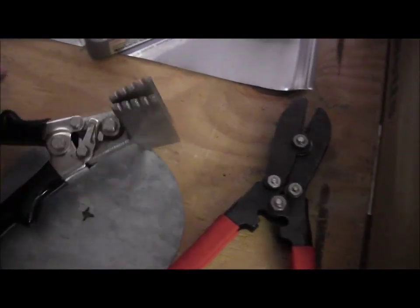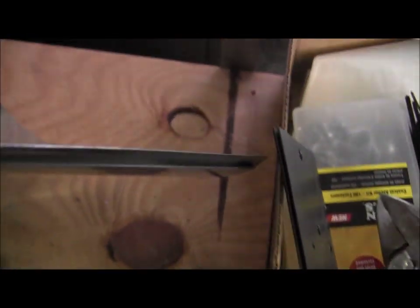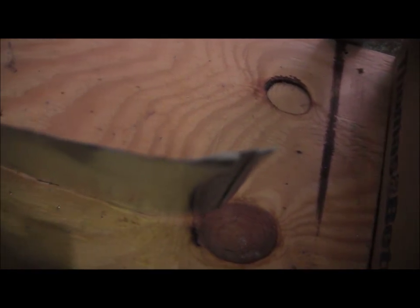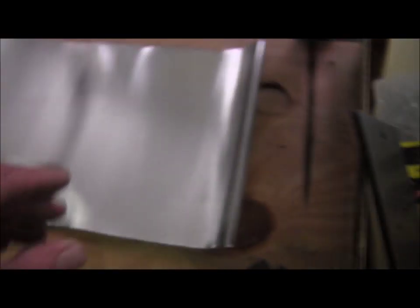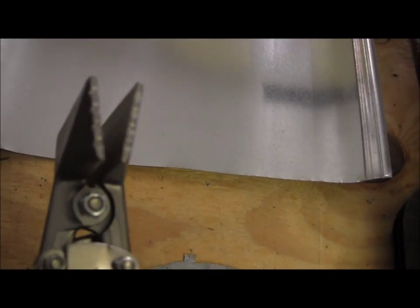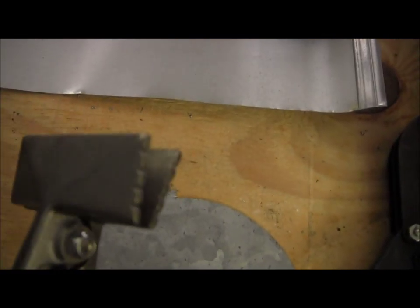First off, with the metal, when you're trying to crimp the joints together and close down the seams, for instance, with this stuff, see there's a seam there in the end of the metal that needs to be closed. That's the crimp joint on the end, and probably a better view of it would be here on the actual duct. As you can see, the edges, as they go together, get a little dinged up. Well, all that's totally repairable with our little crimp tool, which is this guy. And he's gauged. See, there's little notches on the jaw, and the jaw allows for the depth that you need to go to. So he's your best friend. He's like a little brake, but again, he's handheld.